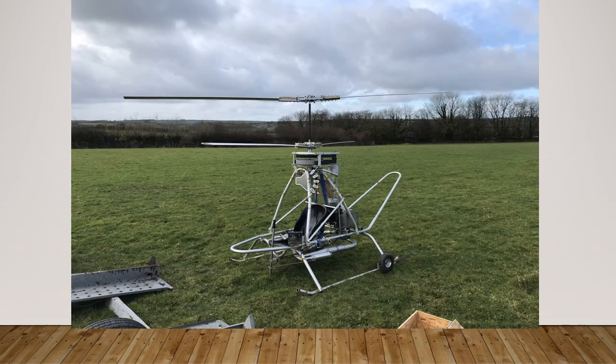I'm going to use my helicopter as an example. The first thing I needed to do was find out the centrifugal force involved for a given rotor RPM. To do this we need to know the location of the blade's centre of mass — I've done a video on finding this which I will link in the description.